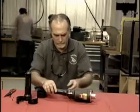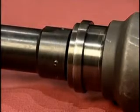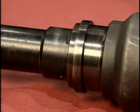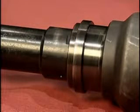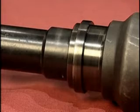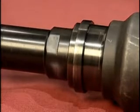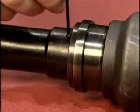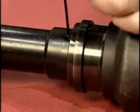Next, you're ready to attach the nose assembly. Begin by attaching the thimble to the piston. Just thread it on as shown. You'll know it's on correctly when the machine flat at the base of the thimble disappears just below the cylinder housing. Line up the Allen screw to one of the 4 grooves machined into the piston and tighten the screw.